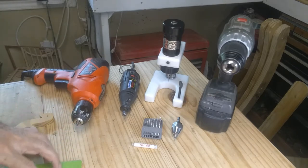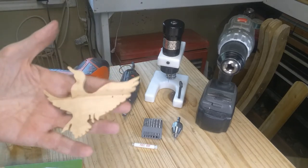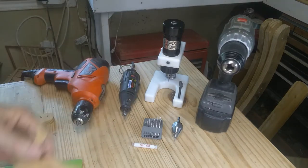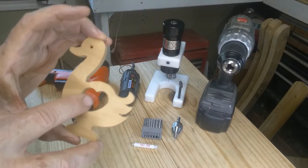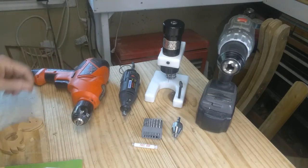What I want to talk about today to start with is if you're cutting just outlines then you just need the saw. But if you want to make an internal cut like this, then you need an entry hole for your blade to go through. To do that you have to drill a hole.